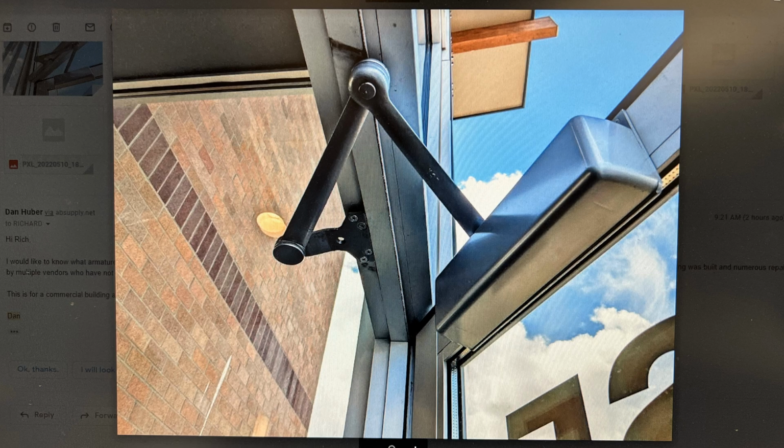I just, because that fifth hole is going to be able to go up into the soffit or the rabbet. Is it the rabbet? Is that what you call them? Well, where it's currently installed is in the rabbet. You're going to move that to the soffit. Yeah, that fifth hole is going to be, when you move that parallel arm bracket in closer to the face of the door, there'll be nowhere for the screw to go through that fifth hole in the parallel arm bracket. And they use those blade stop spacers to stabilize it so you can run that fifth screw.